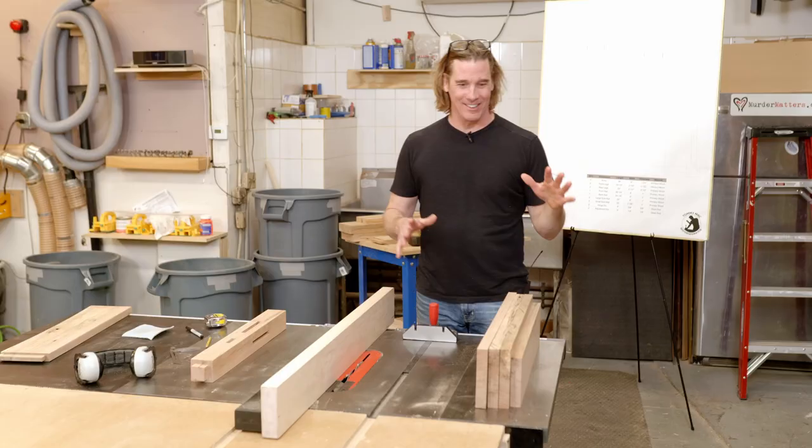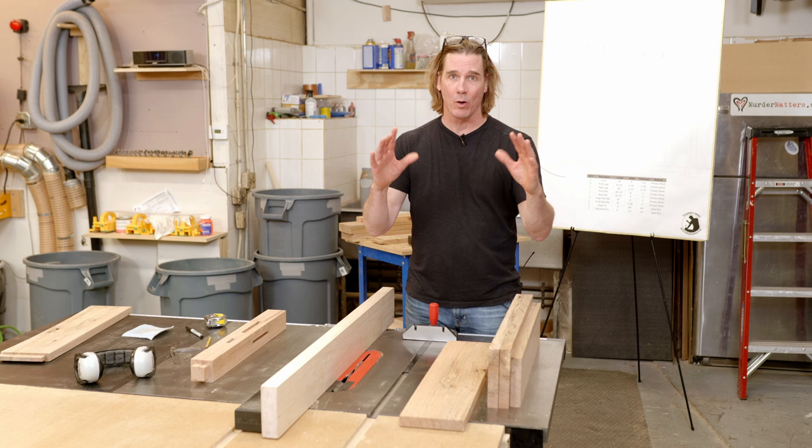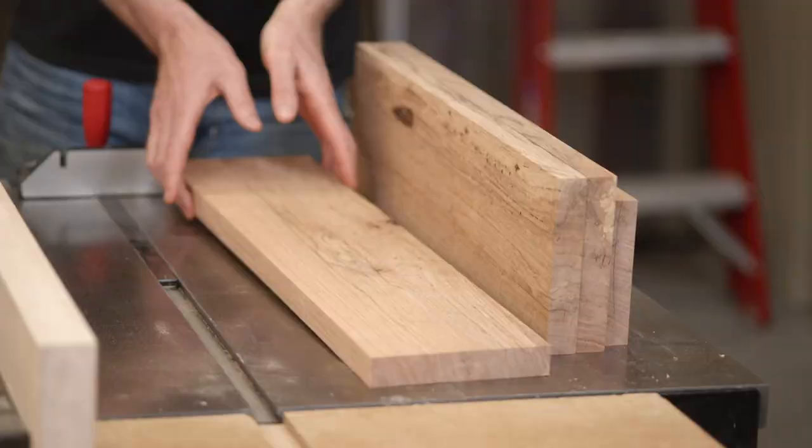The first thing I wanna talk about is the material. When it comes to the material on the rails, what you need to do on a long piece is make sure that you cut the middle of it out for the front so the side rails basically go around and it all looks like one piece of wood. It's really important because when you look at a chair from afar, you want it to just look sweet. These are pretty simple, to be totally honest with you.